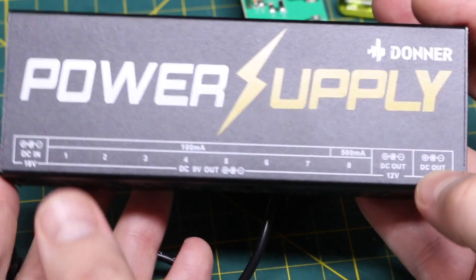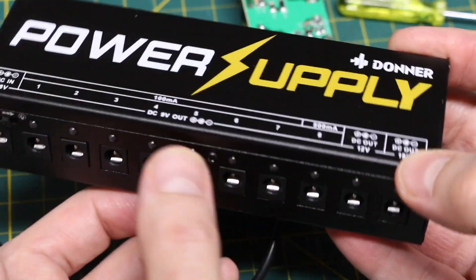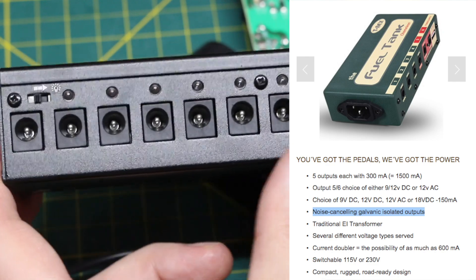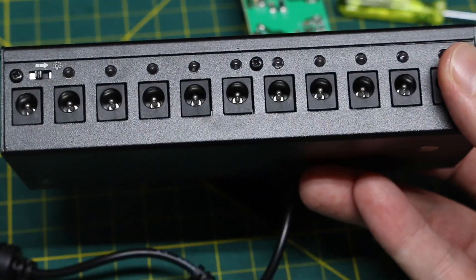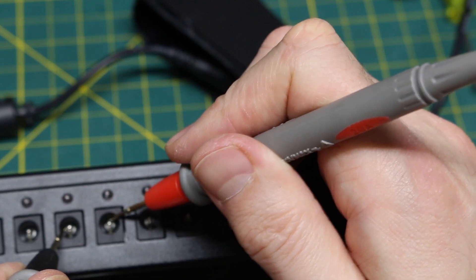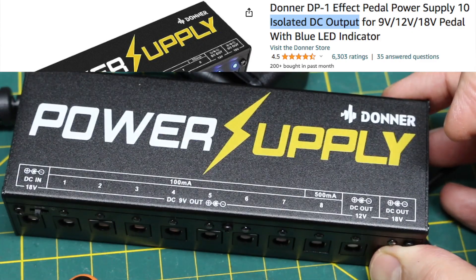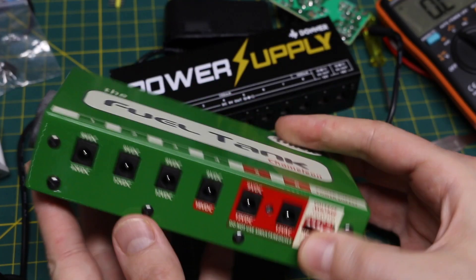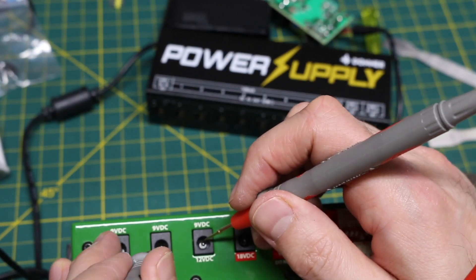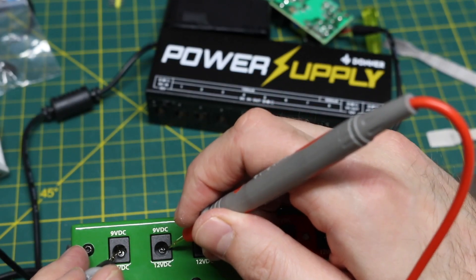The better power supplies take an input power source and split it into multiple 9-volt rails for guitar effects and maybe a few other voltages. Ideally these should all be electrically isolated from each other, but these are common ground. Guitar effects have a center-negative connector, so we go center to center — and they're not isolated, even though a lot of supplies like this are advertised as isolated. Here's an example of a better, more expensive one: with our multiple 9-volt outputs center to center, there is no continuity — and that's the way it should be. Isolated.